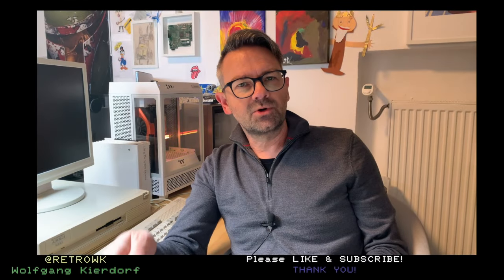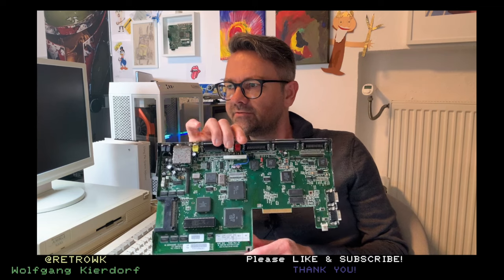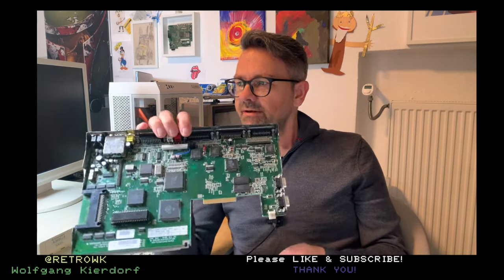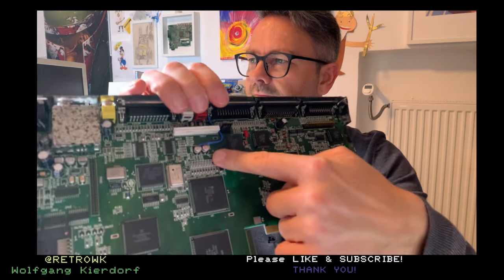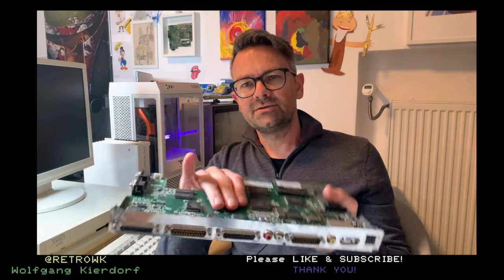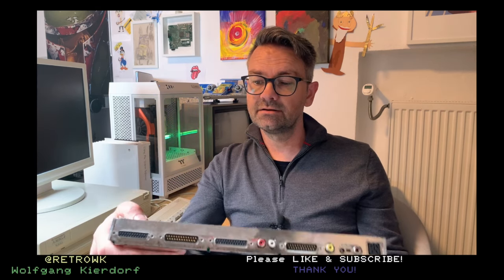Today I'm introducing a new project. It all started with this A600 board which I bought off eBay for about 100 euros. I didn't see in the pictures that it was actually pretty corroded. When I tried to recap the board I pulled a trace - I had to do some botch wiring, but it's just a ground plane so that wasn't too big of a deal. Then it dawned on me I don't have a case, I don't have a keyboard, and it seems one of the CIA chips is broken because the disk drive doesn't work.